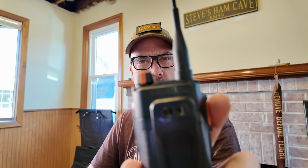It will work with a Bluetooth earpiece. If your earpiece has a mic, the radio also supports transmitting via the mic. So all you need is a PTT button, which it's got on the side of the radio. It is IP67 waterproof. We kind of thought that with the icons on the back of the radio. It has GPS and APRS. I did see the APRS settings. I didn't see where to turn beaconing on, but I haven't looked hard yet. I will look into that. GPS has not gotten a lock yet, but I am indoors. Transmit and receive on both UHF and VHF plus airband and FM reception. We saw the FM reception.